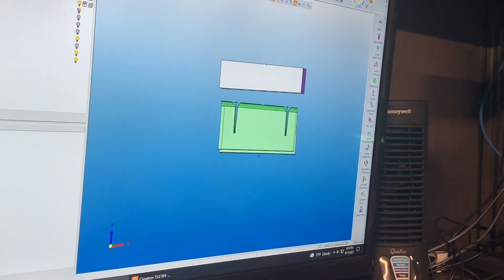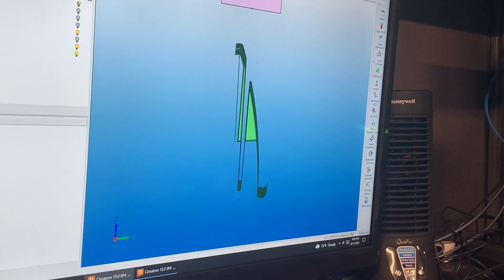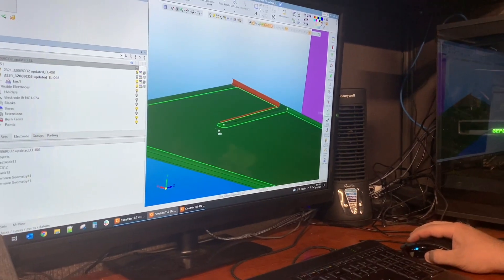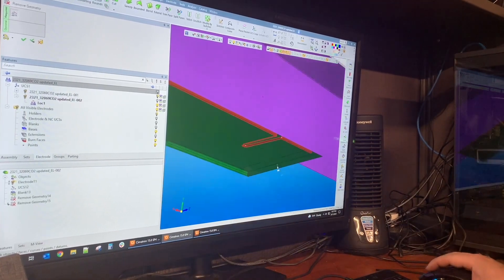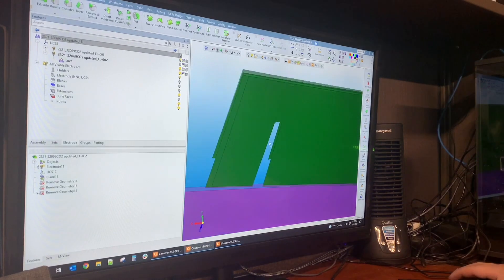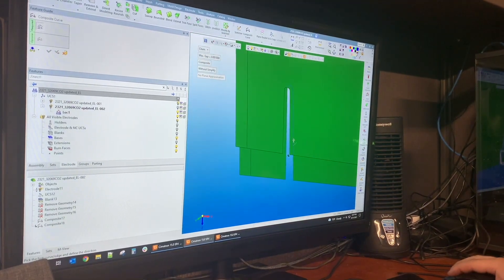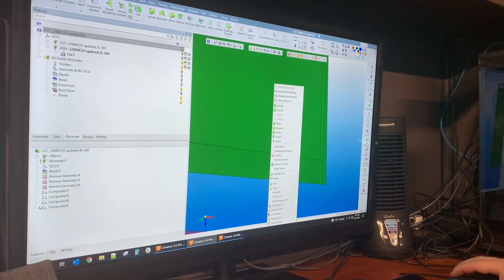In this process we basically have to decide how big our blank is going to be — the graphite or the carbon. Some people use copper, but we're going to be using graphite. There are a lot of extra surfaces we need to get rid of, and we'll also be filling all the little holes in the sides of the electrode. When you make a burn in a rib like this, you want to make sure you go past the end because you have to account for overburn — the electrode moves back and forth in an orbiting fashion. We extend the ends out just a little bit to make sure that overburn area doesn't create a meniscus or little wedge of material.